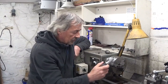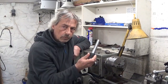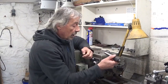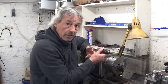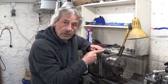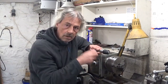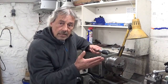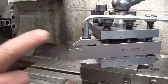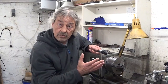This taper goes directly in the spindle. It's a thing I made a few months ago. But the shank on this side was way too long. So I installed it in the spindle to make it. And with my parting tool, I wanted to cut a piece off. And this is where the insert exploded. Twice. So my parting tool has some serious damage, which is a bit of a pity because it was a brand new one, but we'll see if I can recover it.